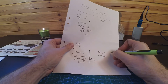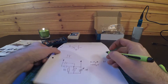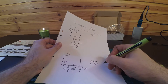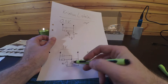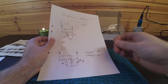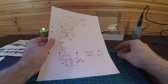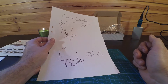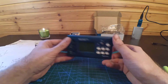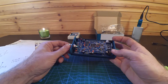My oscilloscope is version H, and in the schematic for version H, C7 is 120 pF, but in the earlier version F, C7 is 100 pF. So I have one here and I'm going to try replacing C7 with the new one, and then also the variable capacitors. That's the boring part to watch, so I'm going to take this apart and you're going to watch a small time lapse while I mess around with the components.